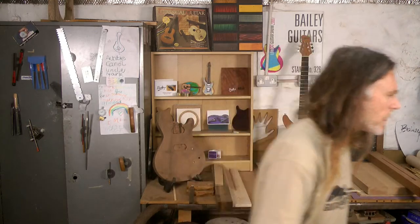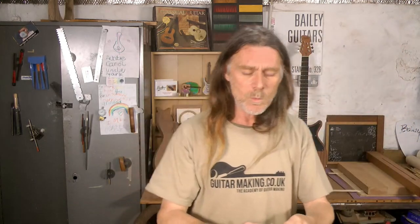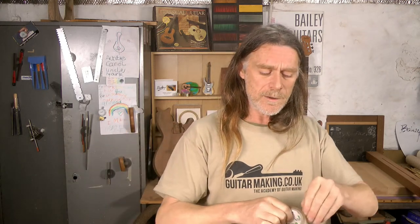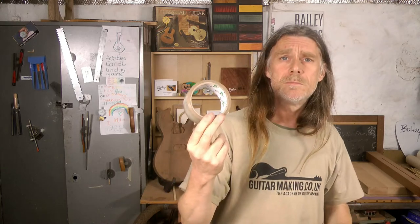Oh no, not quite ready for that yet. Sellotape. Well, is that super contrast. Sellotape, right? Believe it or not, we use sellotape in guitar making. As you'll see, towards the end later on, I'm going to play a slideshow, which is a complete acoustic build. And I'm going to point out all the clamps that we use along the way. We use sellotape, believe it or not, to stick the binding on whilst the glue is drying. The advantage of sellotape, it's transparent, so you can see through it, which helps when you're doing awkward operations. It's flexible, so it's great for doing those curved shapes on binding. And it's cheap. So there's three good reasons to use it, hey?